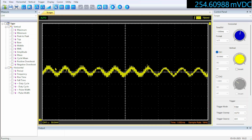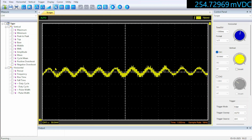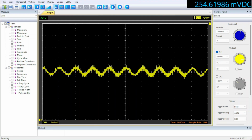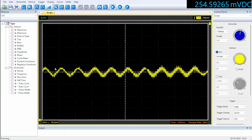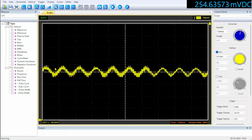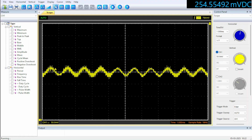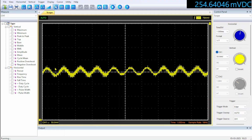I couldn't understand it. At first I thought there was an error with the software, that you couldn't remove the DC coupling on the input, and I also thought that when it said the input max was 5 volts, I was assuming that was 5 volts per division. No, if the input DC goes above 5 volts, the scope won't show it. It might have its uses, but I don't know what for.